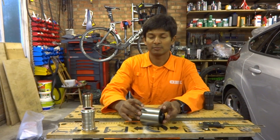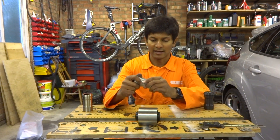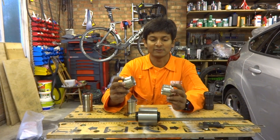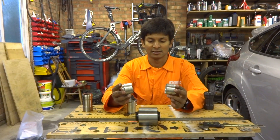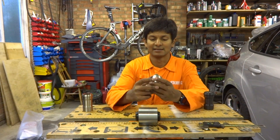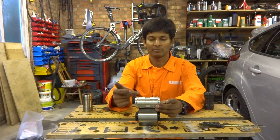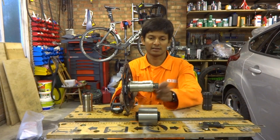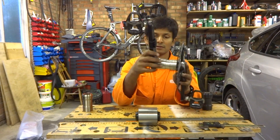The next most popular system is to change the bottom bracket completely with one of these three-piece style bottom brackets — Rotor make these, as do a few other manufacturers. The way these work is very similar to how Shimano envisaged their Hollowtech system to work: moving the bearings to the preferred position, which on a Shimano system is 90 millimeters across the edges. The two cups slot in from either side, screw up, and a centre sleeve sits in the middle acting as a dust seal. The crankshaft goes through and the 90-millimeter spacing is maintained.